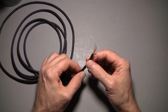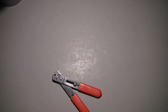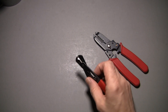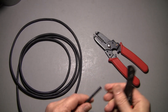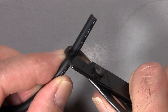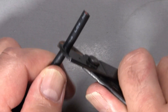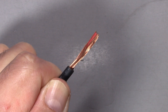It is suitable for either line level or microphone level. Let's strip this wire using the kind of stripper I like, and then I'll show you how you can do it with the other type. You can just adjust and nick into the outer jacket — be careful not to go through the inner insulation. If you want to be a little safe, you can pull it down a little further from where you cut and pull it off.